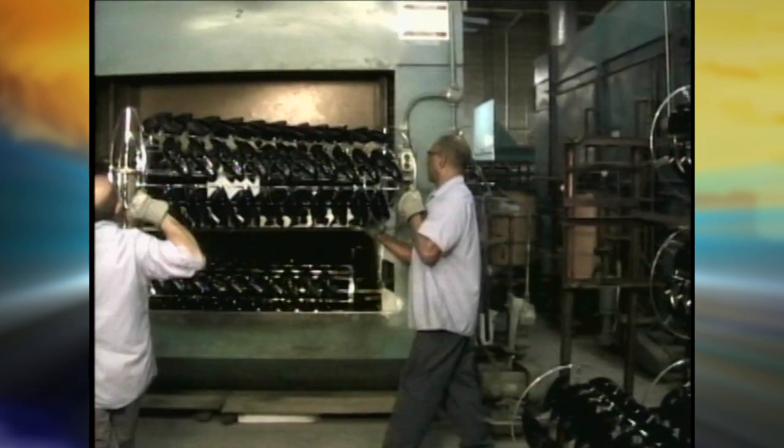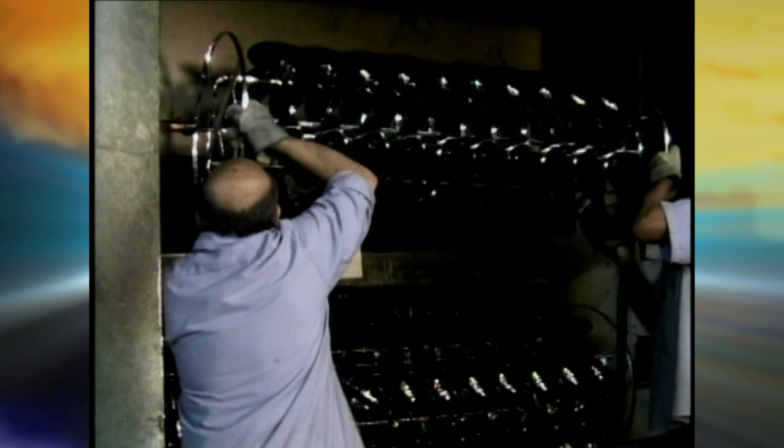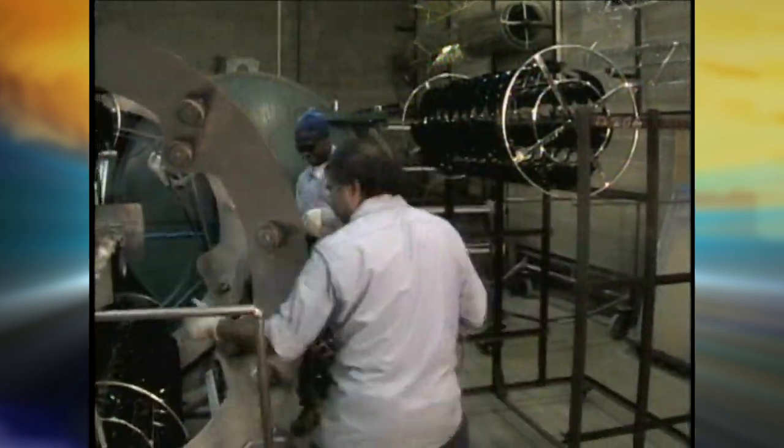The metallizing process begins when the parts are loaded onto a custom-built rack. These racks allow for the maximum number of parts to be coated at once and drastically increases efficiency. The individual circular racks are loaded into a machine that performs two functions: the parts rotate down through the machine receiving a layer of clear coat, then as they rotate up over the top, they pass through a small oven. This heat provides an initial cure to the clear coat, and multiple coats are applied at this same stage.